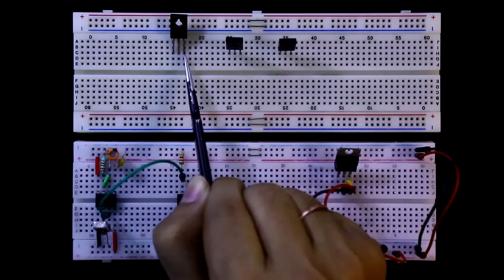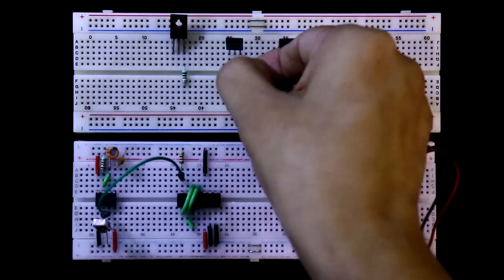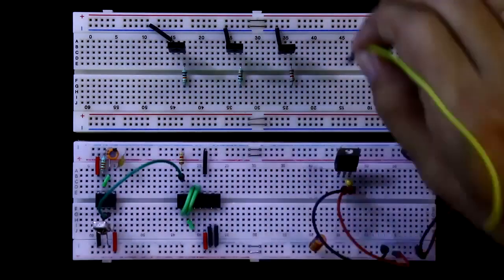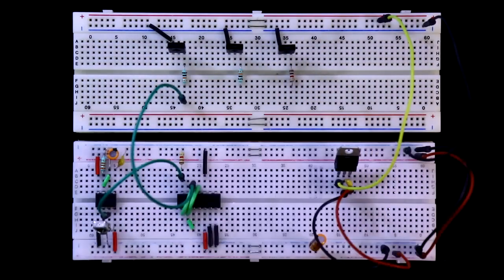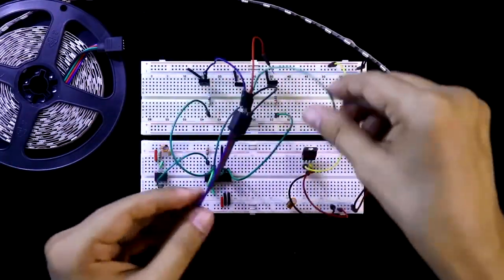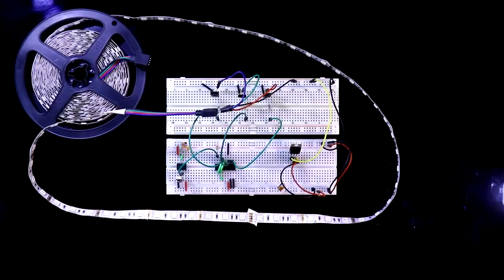Now I will take another breadboard and place all 3 transistors. The base pin is on one side, the middle pin is the collector, and the other pin is the emitter. With two of the transistors I am connecting 10kΩ resistors, and with the third one a 1kΩ resistor. The emitters are connected to the ground rail. This ground is also connected to the first breadboard. This rail will supply 12V, which also connects to pin number 1 of the 7805. Pin number 12 connects to one transistor, pin 9 to another, and pin 8 to the third. Blue connects to one transistor, green to another, and red to the third. The black common anode pin connects to plus 12V.